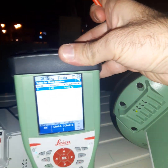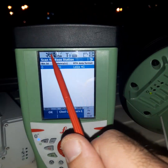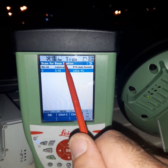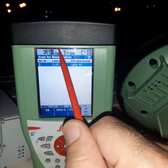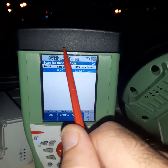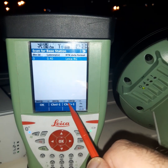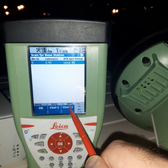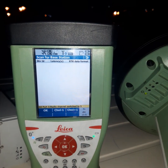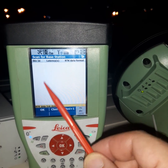The rover radio is communicating with the base because the numbers are appearing — this signal comes from the base station. The arrow indicator on the rover shows small and big pulses incoming, while for the base it goes upward. If you switch to another channel such as channel 3 or 4 and no numbers appear, that means RTK data link is down and the radio is not working.